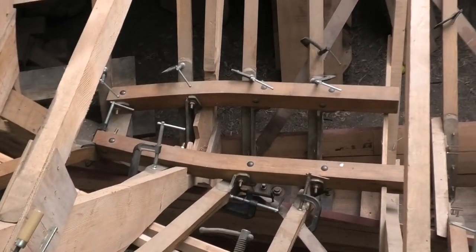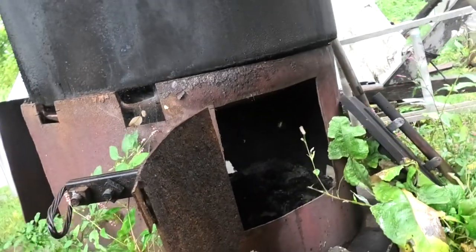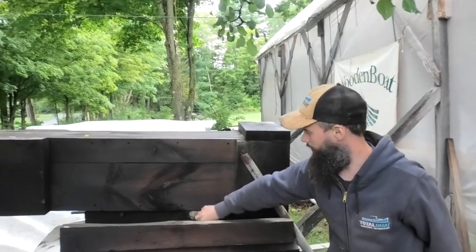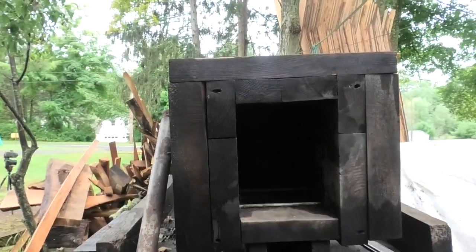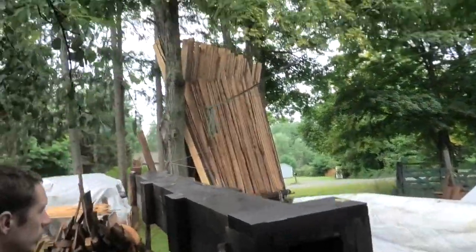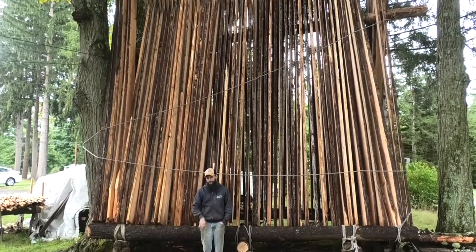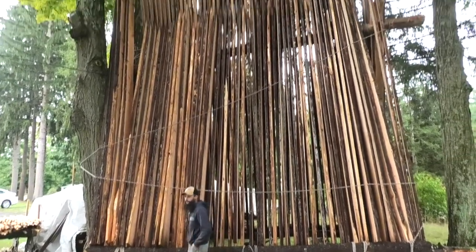I love the look of the marriage of steel and timber. This is our steam box — essentially just a big wood stove. We add a roaring fire, it holds about 50 gallons of water, and that connects to this box. We stick the timber in, it goes down and fills up with steam. None of the bending happens until after they're out — they're steamed and then you have just a couple of minutes to bend them. We open up this wall here to give direct access and bring them right in. And that's our big cedar rack — all our planking is stacked there.